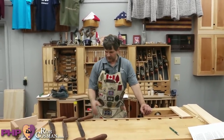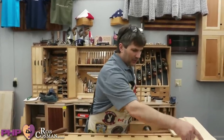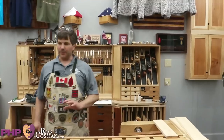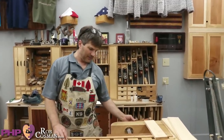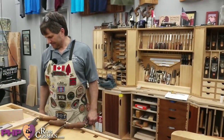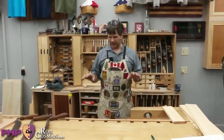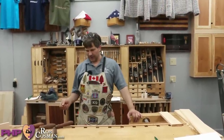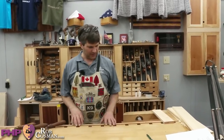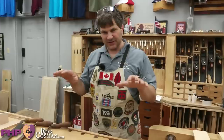You'd want to make a horseshoe-style bench with a fairly deep horseshoe so you have lots of surface area to push against, while keeping the area free to get your chair around it. There's also bench hardware with a scissor lift so you can raise and lower it easily — that might be something to look into, since you'd want it fairly low when planing but higher when cutting dovetails or joints. A horseshoe bench with a scissor lift would be my best advice for the bench side of it.